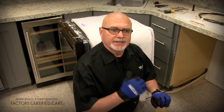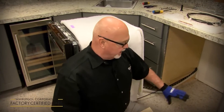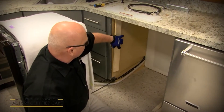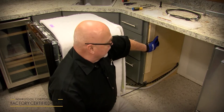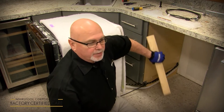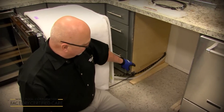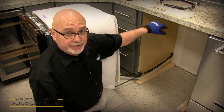As referenced during the unpacking portion, you might want to save the boards that come in the shipping base. You may use them if you've got a built-up floor, or if you've got an extra-wide cabinet behind the fascia board and you're side mounting it — these work great as shims. If you've got a wider than 24-inch cabinet cutout behind the fascia board, there's nothing for the screw to bite into, so you can use the boards to shim it out on both sides to 24 inches wide so the screw has something to bite into when you side anchor. On a built-up floor in an older home, use the full-length boards cut to measure so when you slide the dishwasher in, it stays even with the floor and you don't get a gap at the top.